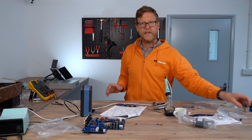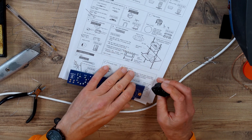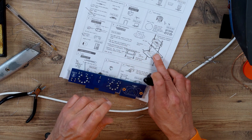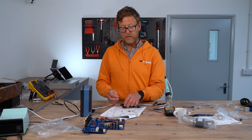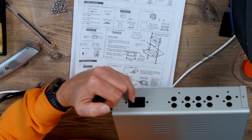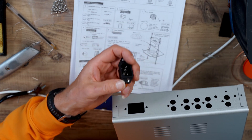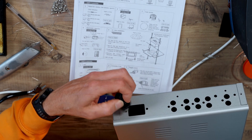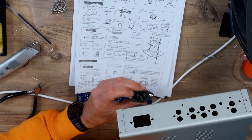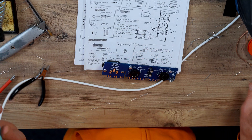So now we're fitting the IEC here, which goes in there, but it needs standoffs. Before fitting, you need to put the standoffs here — you can see the screws here. You're actually just fixing these on temporarily to keep them in place. So those screws come out, it comes in — loosen them, then solder these in.